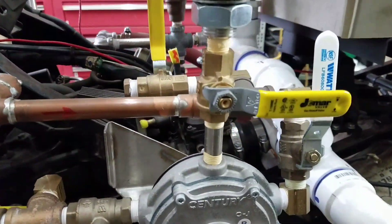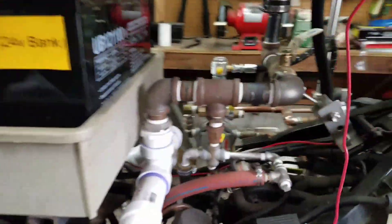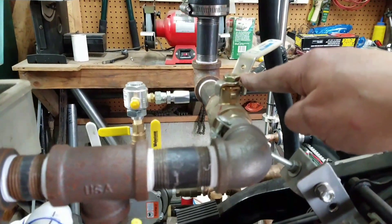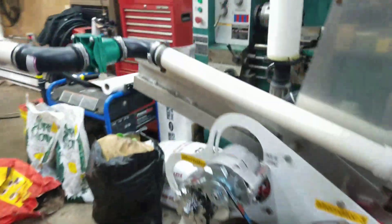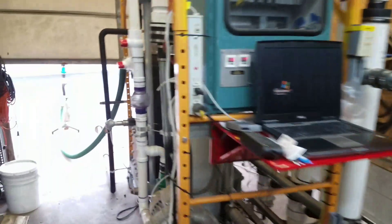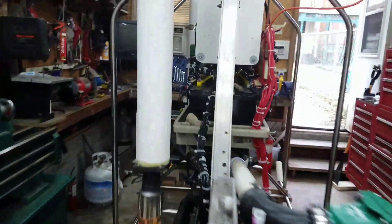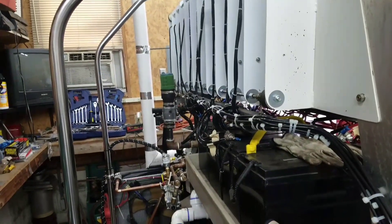What I'm going to do first — just to show you that I did this — you can see the frost line on that tank. I had it running on propane for a while. That valve is off, and this is my fuel line going to the Ninja right now. The only other adjustment I have right here is this is my air intake, you can see the filter on it. That's the air intake control for the wood gas. And then this is my fuel shutoff for when I want to run it on propane. So I'll open that, close this, and open this, and let it push the wood gas over to the Ninja.